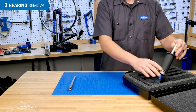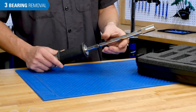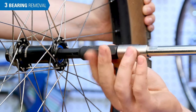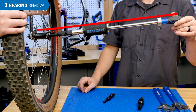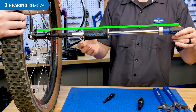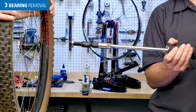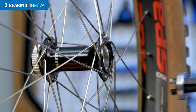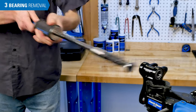Next, assemble the SHX-1. Thread the shaft assembly onto the extension and thread the coupler fully onto the collet. Be sure the handle stays in line with the bearing during use. Using your stronger arm, pull back on the slide quickly to strike the plate on the handle. This impact pulls the bearing out. It can take several impacts to move the bearing out of the component.